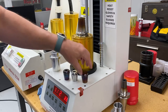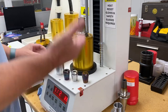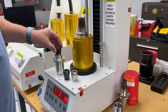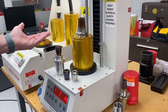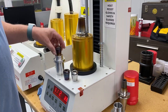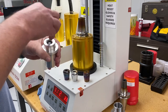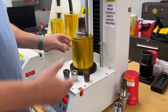So we came up with this system. Originally I came up with an aluminum little fixture with a preset screw to locate the cutting tool. But if you look at this collet, it's lighter here and darker here — I found the aluminum was reflecting the induction field up high and not heating the bottom of the collet all the way. So we went back to the drawing board and changed the material so that it will absorb the heat and also help in the transfer of heat to the bottom of the collet.